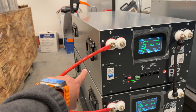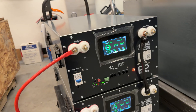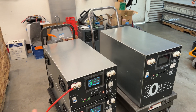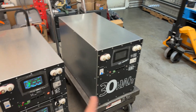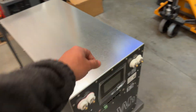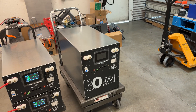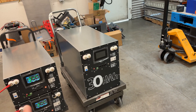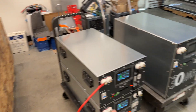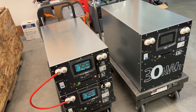Also think about the hardware. These were put in handles because they're about 230 pounds, so two people can lift them and position them. On the big single box, we're completely foregoing the handles because we don't even want you to attempt to lift it — it's like 500 pounds. Instead, we give you a hook so you can use a hoist, an engine hoist, a forklift, or a tractor. We also ship them on a dolly with wheels so you can roll it off the pallet. You're also saving money because we don't have eight handles. And the terminals: there are two on the single box versus four on the two-box setup, so you save the cost of two terminals.